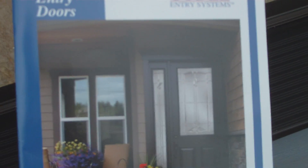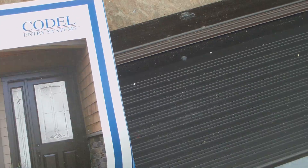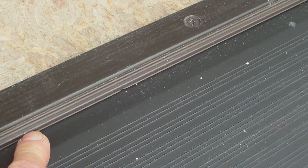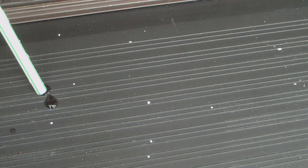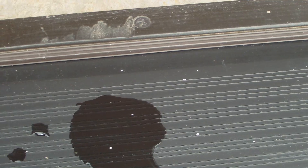Even this thing fills up with water, though obviously not now because it hasn't been raining. I've done quite a bit of research since this water problem started — I want to finish my building soon. I don't believe this door is very well designed with this rubber bumper gasket. Watch this — the capillary action of the water — we'll put a straw's worth of water right there, and technically the water would go down, which is supposed to happen.